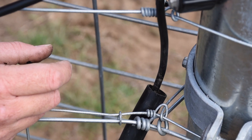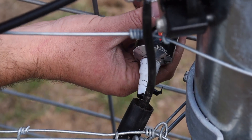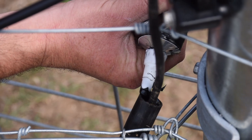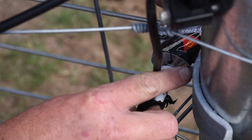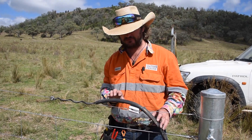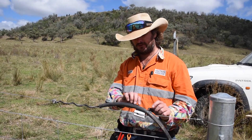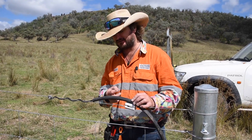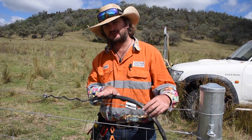We've got two processes left to go. One is silicone flexing the end of the poly pipe so that ants and water can't collect down there. We'll just squeeze it in here, get a fair bit in there, plug it up and make sure it's fully around the cable — job done there. We've also quickly ducked over to another fence to show the usual way we do this technique: we've brought it up and arched it slightly downwards so it doesn't collect water naturally. We've plugged this end up with silicone flex just the same, but this is the way we would normally do it.